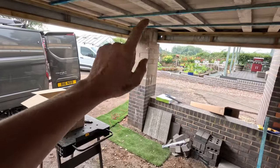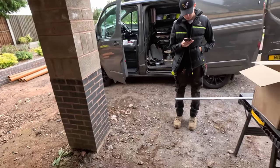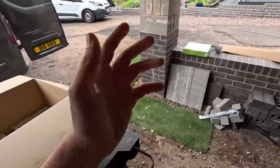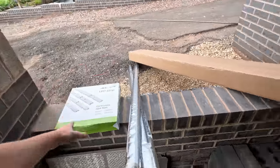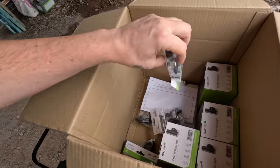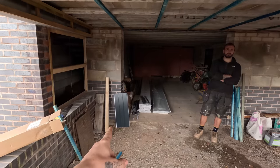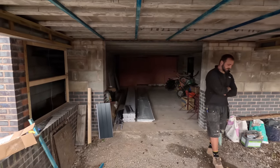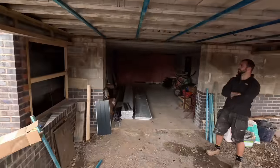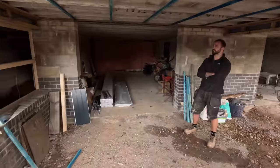Where the hole is drilled is going to be a sensor, so the customer pulls around - the three up-and-down lights going on the outside of these pillars. JCC have sent across four aluminium profiles for the LEDs. We've got 50 meters of LED strip over here with the drivers, and some downlights for a later date. Got all these connections. We're doing two lines in each bay, so this sensor will pick up as you pull in and light this ceiling up - same thing for over there.